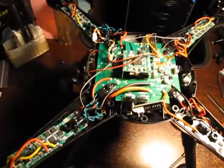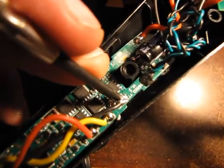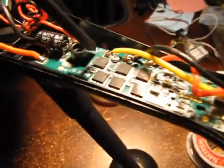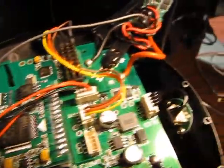Now I've got to clean some runs up — I've got some problems with some runs. This black wire right here is not a very good solder joint. That's not a very good one, looks like a cold joint. And we had a yellow one over here that doesn't look very good either. We're going to put a little heat on it and flow some solder into it. This yellow one here doesn't look that great either — we might repuddle that one. The main board looks pretty good; I really can't see any runs or connection points that look bad.